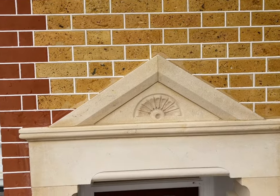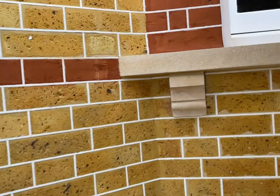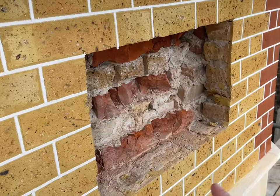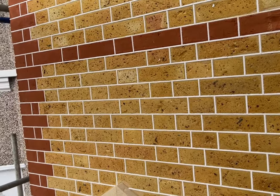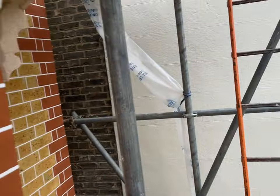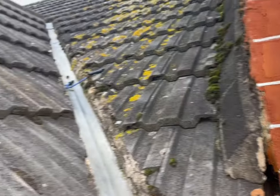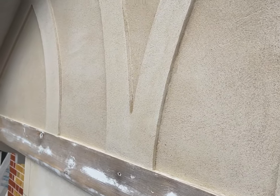On this project we also removed all of the paint and taken everything back to natural stone — beautifully finished, all back to natural stone. We're just waiting for a plaque to be made with some engraving in the middle and a new window sill downstairs on the main bay to finish those bits off. Upstairs, we've also removed the pebble dash off the main gable and re-rendered that in lime with some nice feature bands going through the middle so it replicates the adjoining houses.